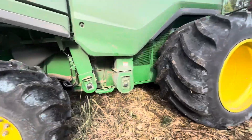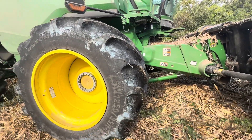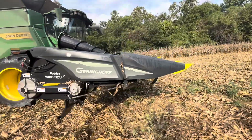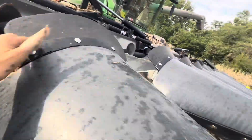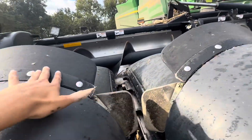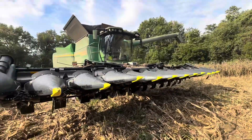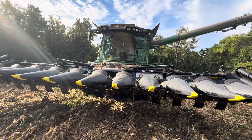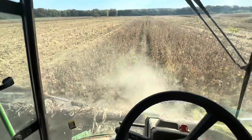Overall the machine is the same — I've been running it for going on two weeks now and it runs like a 780. She just loves to eat. The cornhead is a Geringhoff Northstar and I do not like it at all — it likes to plug. I'm going to take those off once we go to the next field because waterhemp or Johnson grass gets right between the two and won't slide over the tops. But it's not a bad looking combine — it cuts pretty good. I'd rather have a 780 or a 770 than a new S7, though. The LED lights and globes are built in.